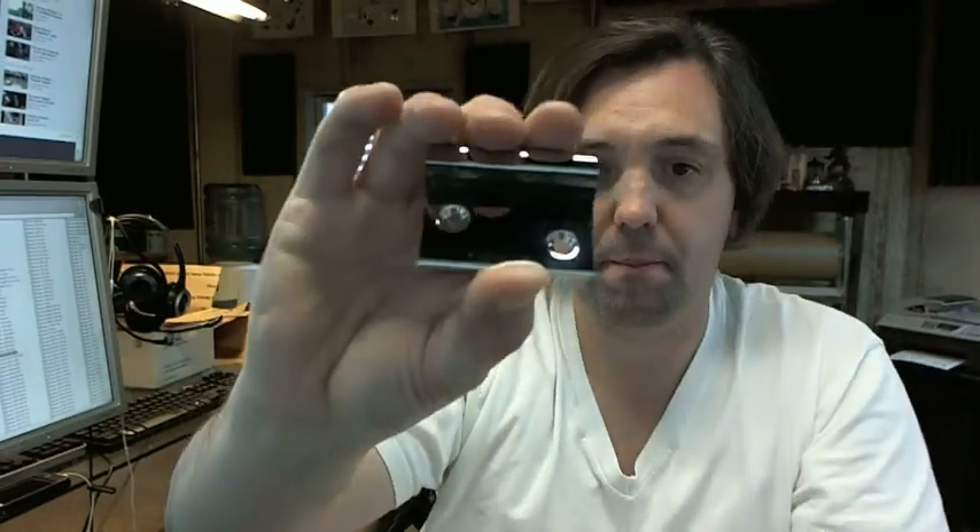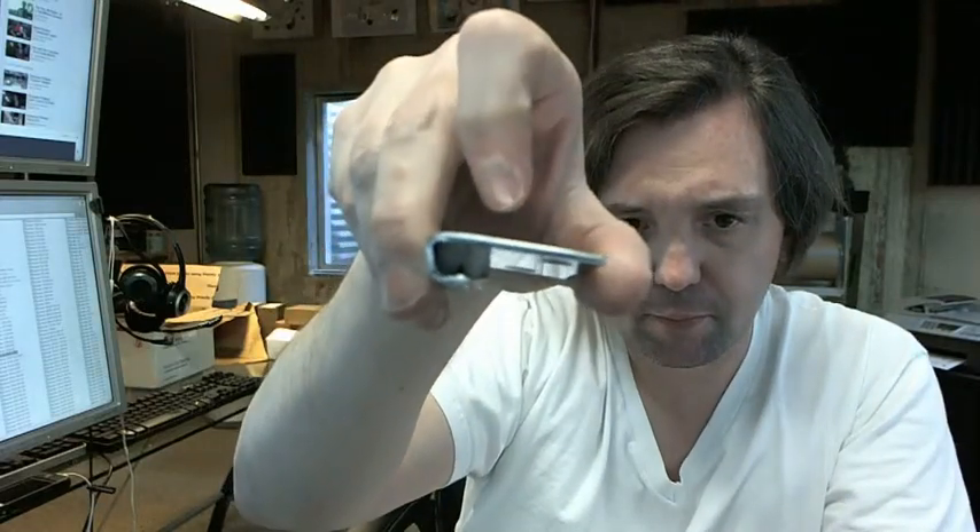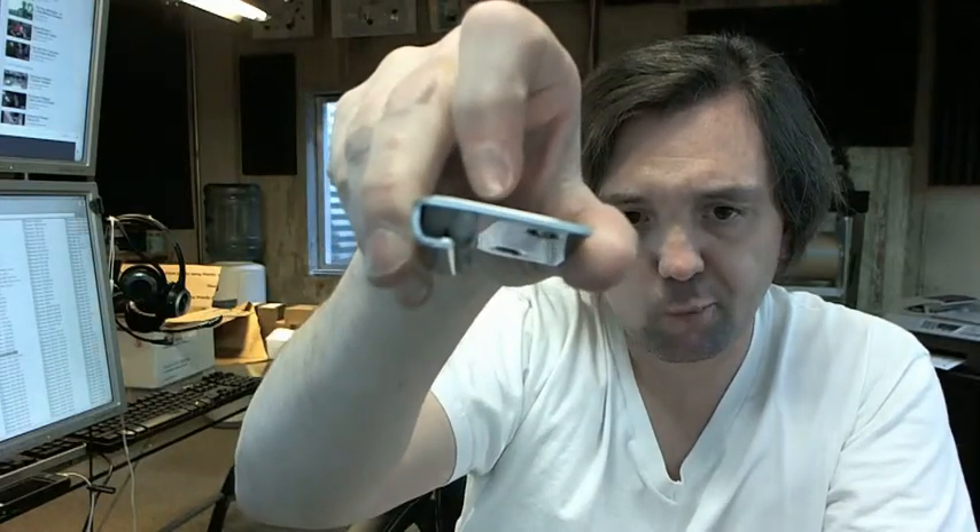The 1072 is representative of the fact that it is a surface applied stop. This could be used on a variety of different door applications — obviously situations where you need to have a stop. You could think of something like this used in toilet partition hardware. You could see this very commonly at the head of a double door on the header, or a single door on the strike jamb, like a center hung pivot style hung door.